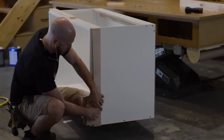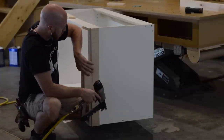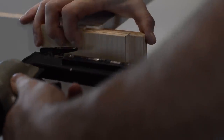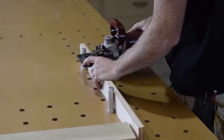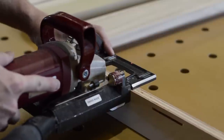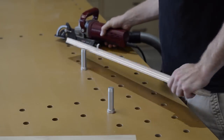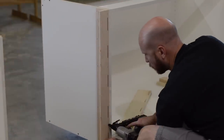Here I'm adding some strips of plywood that the left and right fillers will eventually be attached to, setting them back from the front edge by the thickness of the plywood. Next I summon the Lamello biscuit joiner and drill a series of biscuit slots in a second piece of plywood, then staple that second piece onto the original.